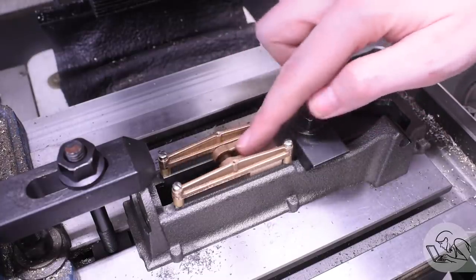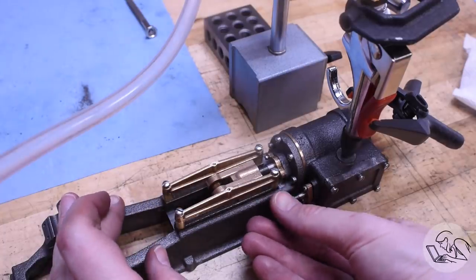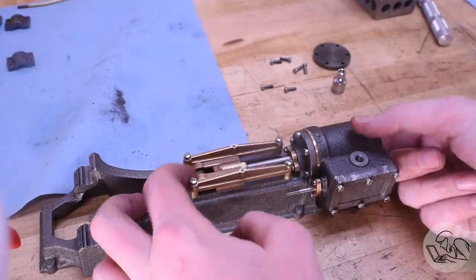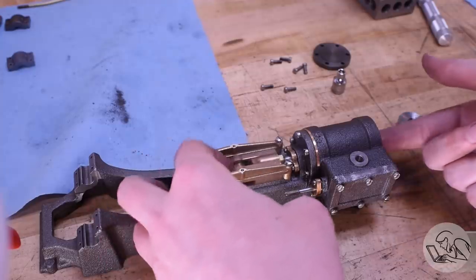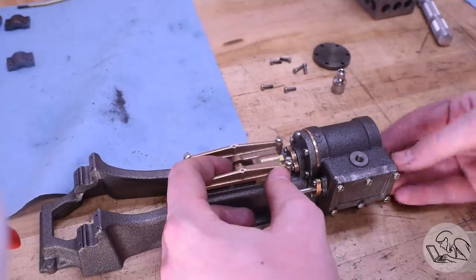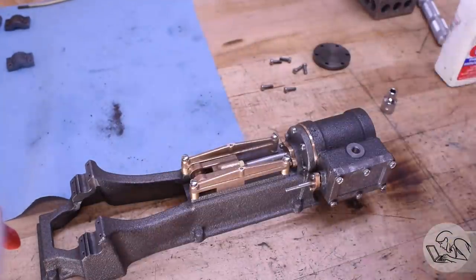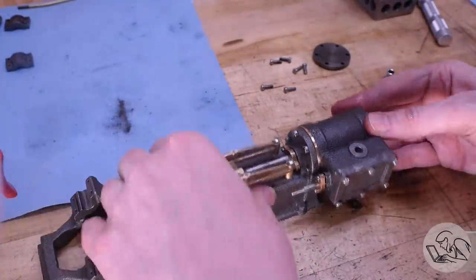Let's put some air on this thing and see what happens. It moves! As I feared, it is a little bit tight - it moves very well in one direction but there is a bit of a stick at the far end of the piston. So now starts the debugging process. Debugging a mechanical system is very much like debugging a complex software system: you start with unit testing, verifying that each component is a good fit on its mating component, then move up to system-level testing where you check pairs of components to each other, and then integration-level testing where you check pairs of mechanisms.